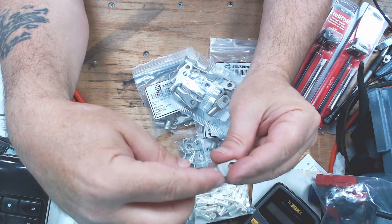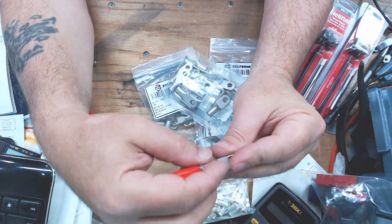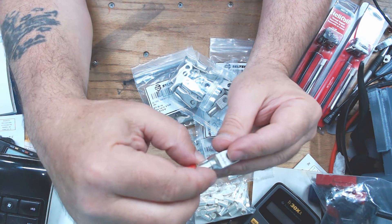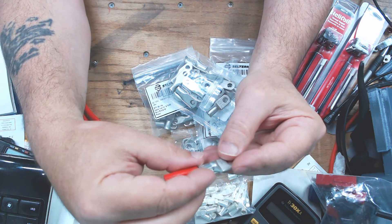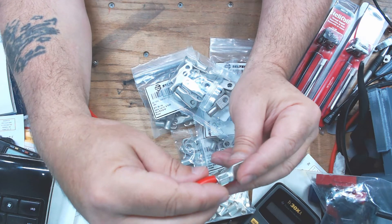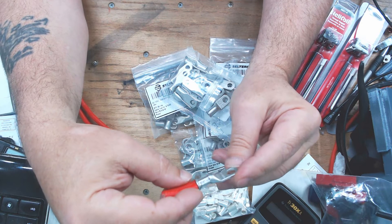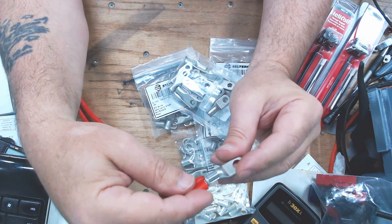So the winner is: a quarter-inch hole, number four gauge lug, accepting two eight-gauge wires with a double crimp. I don't have a problem with that slight flare from the double crimp — you're going over it with heat shrink anyway.